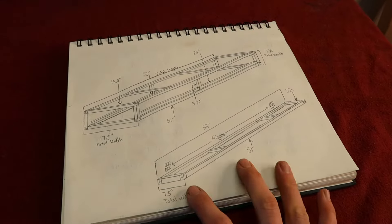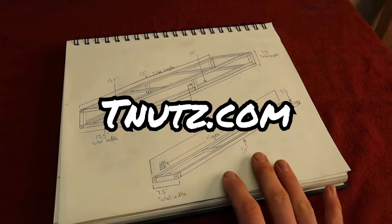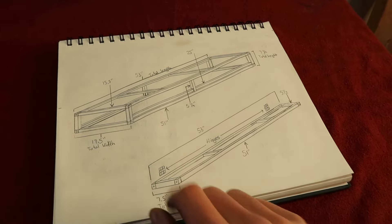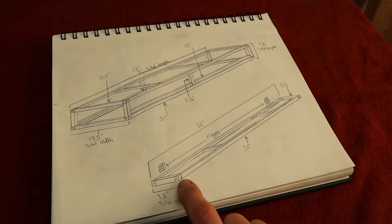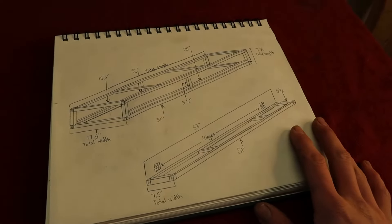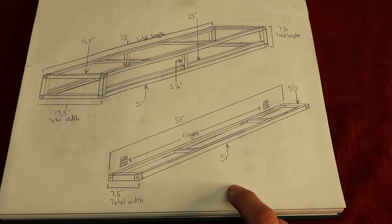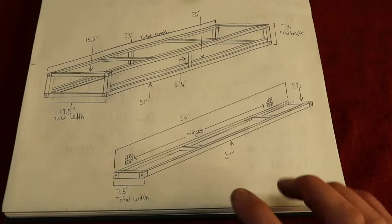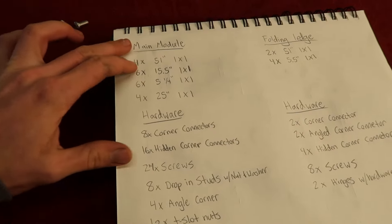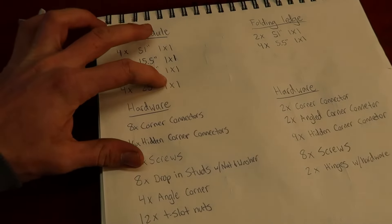Here's the design I sketched up to figure out what size I needed to order for each piece. I use tnuts.com — you go ahead and pick out the type of extrusion you want, enter in the length, and they'll send it pre-cut and even pre-tap the ends, so screwing everything together is just like building Legos. If you want, go ahead and screenshot this or pause it and do a rough sketch of your own. Here is my cut and hardware list from tnuts.com — these are all my extrusion cuts, showing quantity, length, and the size, which is the 10-series, a one-inch by one-inch.